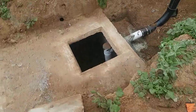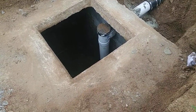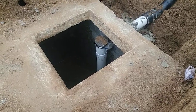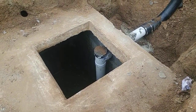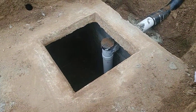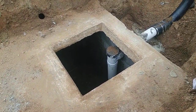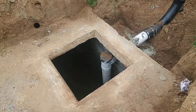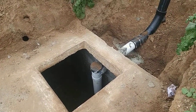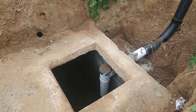As you can see it's a two-compartment tank, and you can see the new line we put in and then there's a new cap on top of that T. A lot of times we'll get a call from somebody saying they smell sewer around their house, and if they're on a septic system what's happened is that cap has either come off or it never got put on. It allows the smell to go back up through the pipes, out the top of the house, and then depending on the air flow around the house it falls down along the outside — and they may happen to have a barbecue that day and it doesn't smell real good.